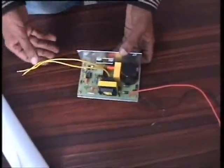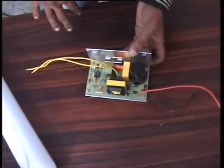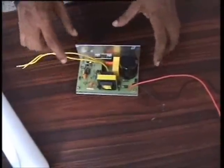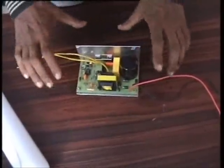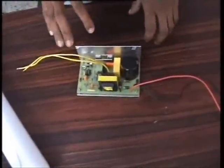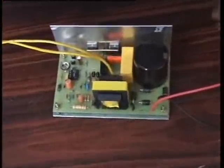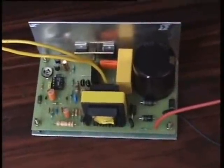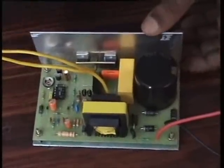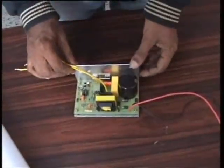For starting of the lamp, 250 kHz above 1000 volts is required. After that, the voltage is reduced. We achieved that entire thing with very few components using one tricky method. Other induction lamp circuits in the market are so complex, which is why induction lamps are not very popular. This is a very low cost circuit for the induction lamp.